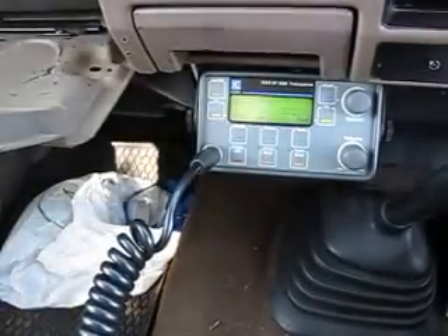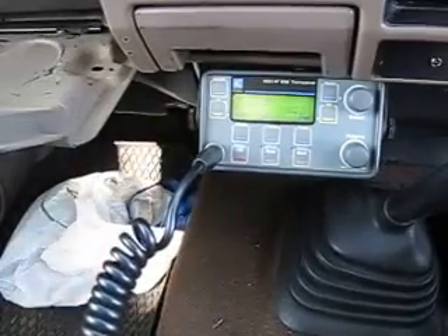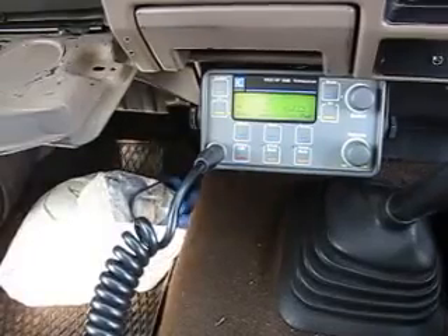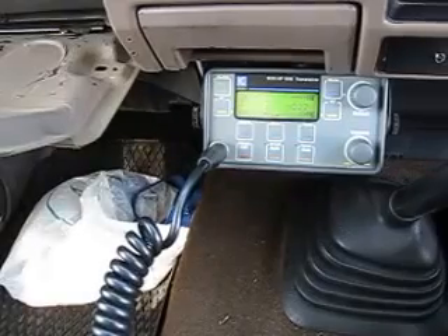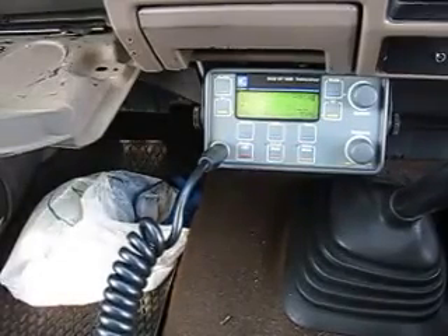As you can see, the bar graph — the power meter indication — was moving up to about a centimeter wide, which proves that the antenna is tuned. We'll press call 81, which is Charleville base, and 99 being the beacon call.